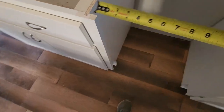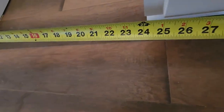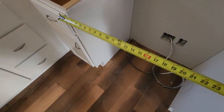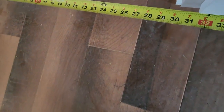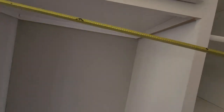We made this length the same as the wall cabinet, so we added a filler here to make this 24 inches. They got 24 here, and at the bottom we have 24 as well. We also have 30 inches for the stove — 30 inches come down here, 30 inches there. And here is the refrigerator spacing: we have 36 inches for the refrigerator opening.